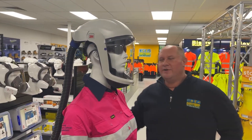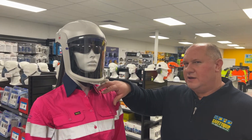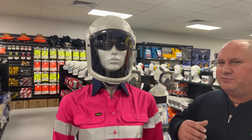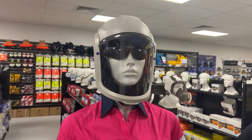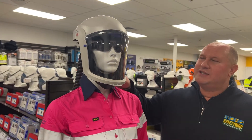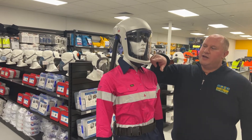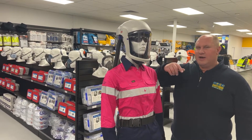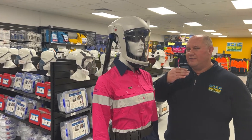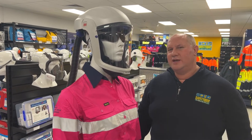There's a variety of different head pieces — some of them are a bit lower, and they contain a hood or a shroud that can be particularly good for somebody with a large beard, a bushy beard. If you're a garden gnome, maybe that's a solution! The point is there's positive air pressure fed into the head piece at higher pressure than outside the mask, so any contaminants aren't getting in around the edge of the face piece — that positive pressure forces contaminants out.